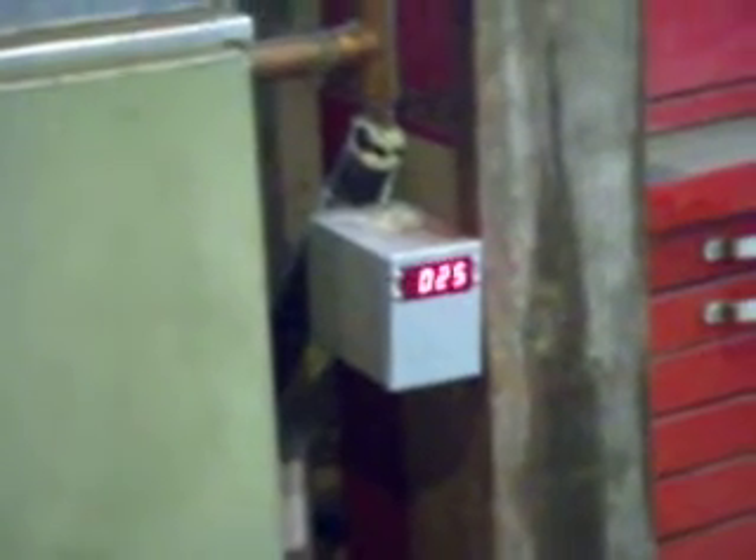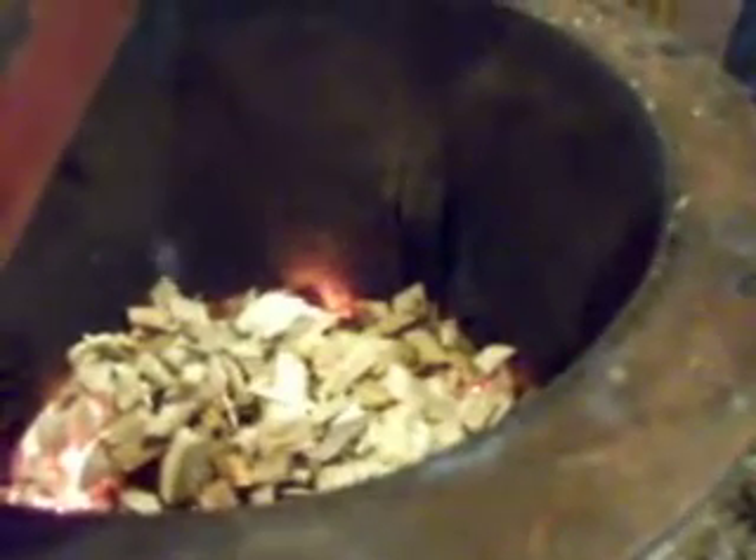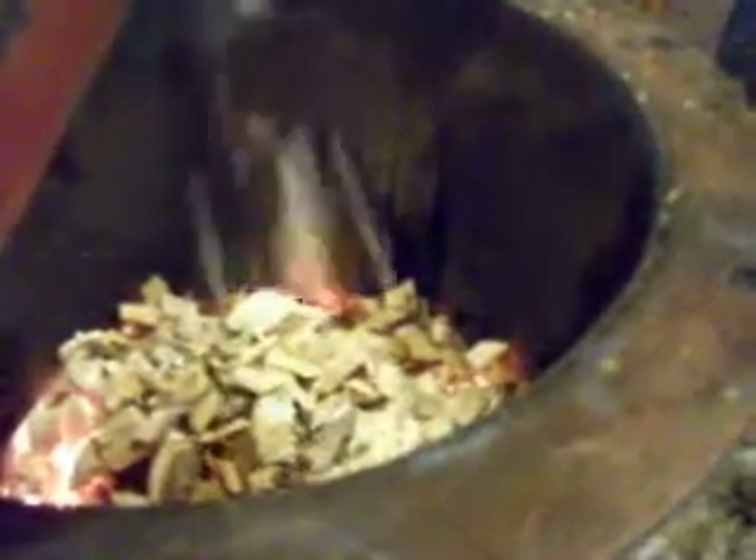That's about 80 degrees Fahrenheit. You can see the fire behind that. I'm still building chips, so I'm going to turn it up a bit more. That's about an inch and a quarter of water column — an inch and a quarter of water column sucking on this system. This is a triple pass fire tube boiler.